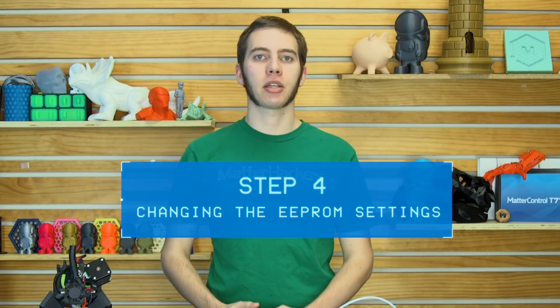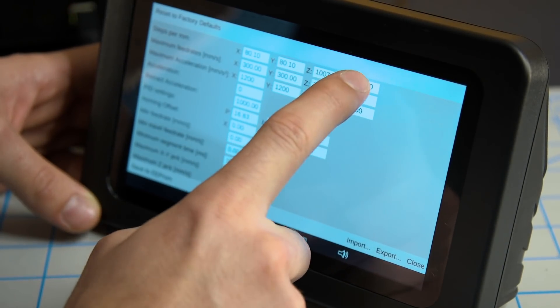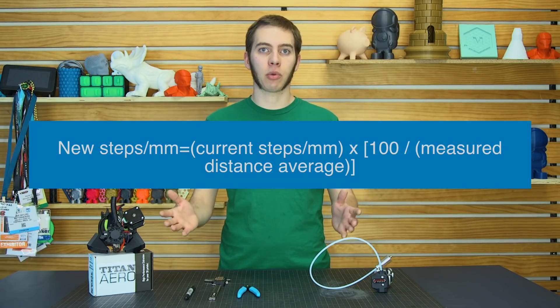Step 4: Changing the EEPROM settings. EEPROM is the set of firmware settings directly dictating how your printer moves and behaves. With E-steps, or extruder steps, these are the ones you're going to want to change. If your printer only has one tool head, it's really easy to figure out. For some printers they may call the first print head extruder zero, for others extruder one. Once you've figured out which one is which, start calibrating. Using the numbers that you found when extruding 100mm and the E-steps you see currently, here's the formula to calibrate your printer. Take this new value, enter it into the EEPROM settings, save it, and we're going to do it again.